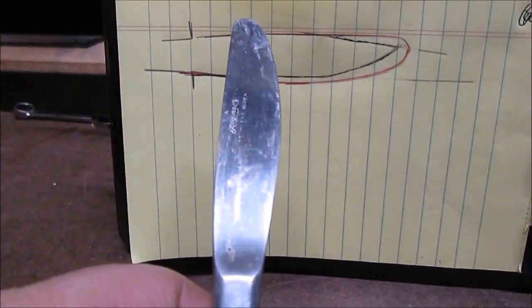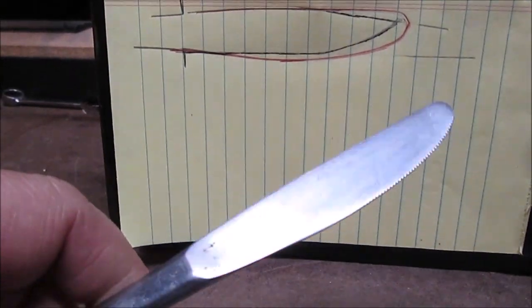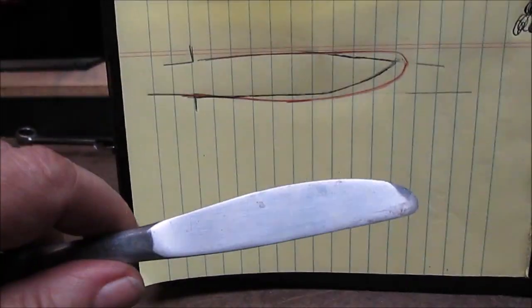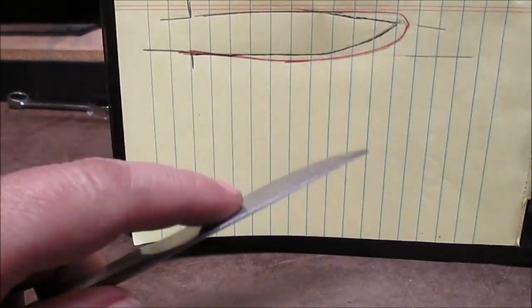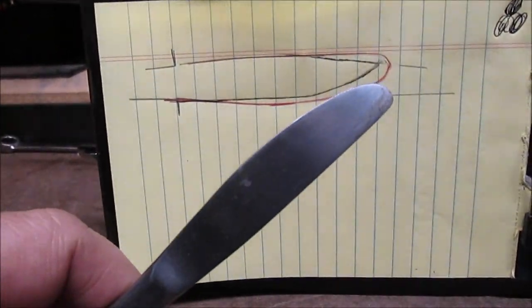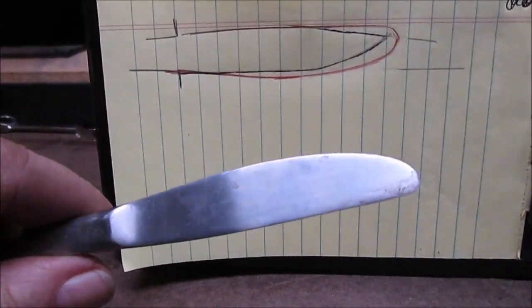And we spray water on it. It's not going to get hot. We're not going to lose the edge or the strength of the metal, the temper, or whatever you want to call it. We're not going to ruin the metal. Trust me, I touch my finger on this stuff all the time to make sure it ain't hot. The diamond wheel removes stuff so fast that it doesn't really heat up unless you're really bearing into it.